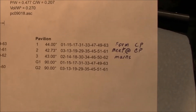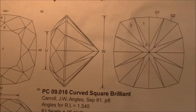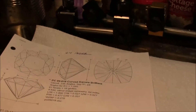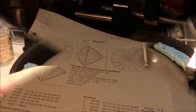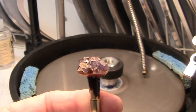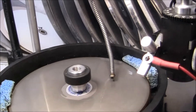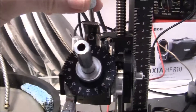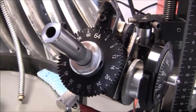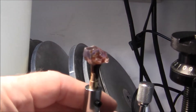I've cut this before, so I've made a few notes here. I don't expect too much trouble cutting this. I've got my piece of rough dopped up with wax and I'm ready to start cutting. I've gotten my 64 index gear installed on my machine and aligned everything up properly. I've got my gemstone mounted into the machine ready to cut.